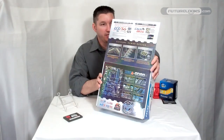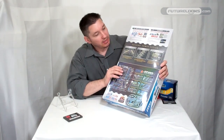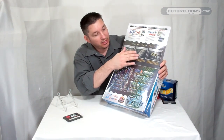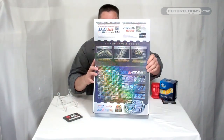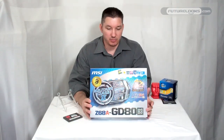So we're going to unbox this for you here in just a sec. The Z68A-GD80 sports a little extra VRM, better power design — 12-phase Driver MOS, CPU power management right around the socket. That's all intended for a little extra overclocking you might see on some of these Z68 platforms.